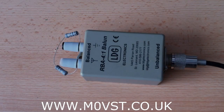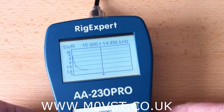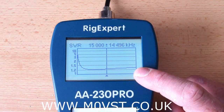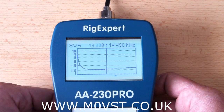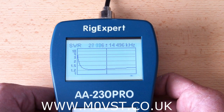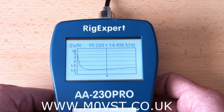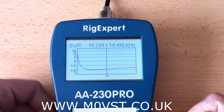I am now going to do the same test with this commercial made 4 to 1 balun. As you can see, it is pretty much the same — slightly lower than the one I have made, slightly lower at the top end of the band. This is it testing baluns, all the way up to the top of 10 metres and all the way down to 160. That is the kind of curve you are looking for with a 4 to 1 balun with a 200 ohm load on.